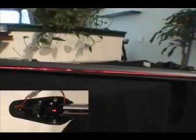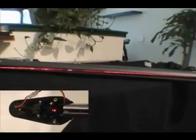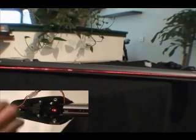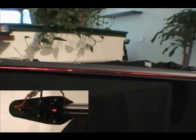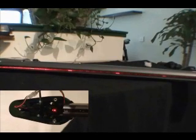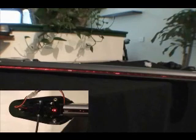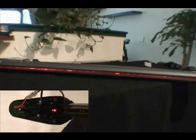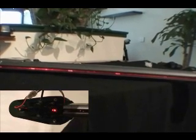First, using the green screws, we are going to create a line parallel with the red lens. The line does not have to be on the red lens yet. In order to alter the line angle, one of the 2 green screws must be loosened and the second green screw must be hand tight. Do not over tighten the green screw because it will cause damage and the unit will not stay aligned.